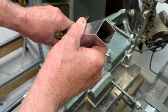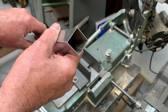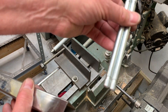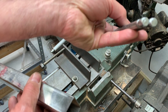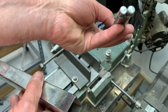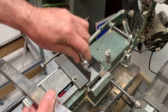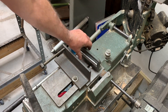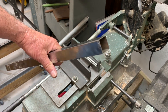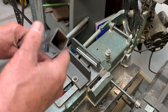The first challenge was how do I keep this at the proper angle without using large v-blocks, and the answer is using these things which I call OO blocks — because a v-block on the side face is a V, and this is two cylinders, so that must be OO. They've got little magnets on them, so I can slap them in here and then mount this so that the bottom corner is right down on the vise ways.